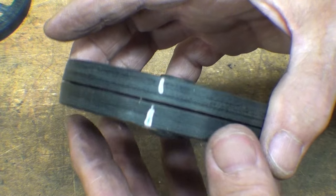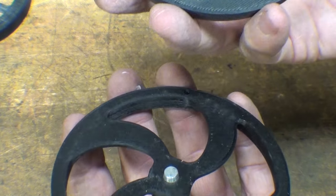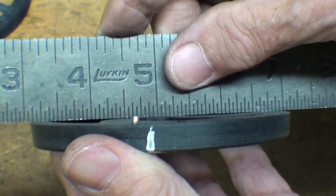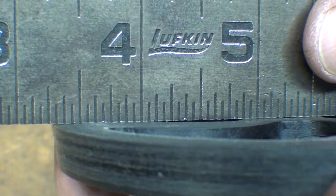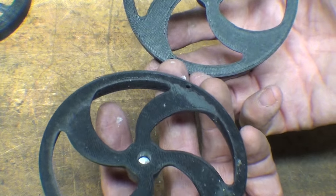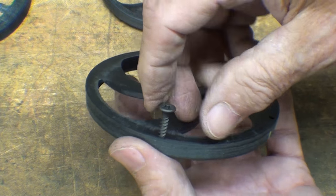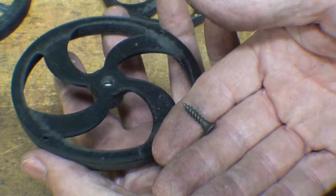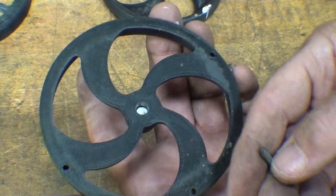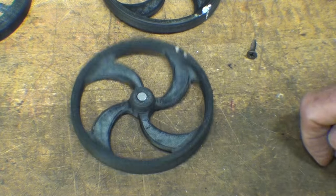This one's ready to go, but there's just one minor problem — even pressing them together there's a bit of a gap. Holding a straight edge on it, I believe there's just a little bit of warpage, but I think I can deal with that. To lift the patterns out of the sand mold I'll use the holes that were already drilled with a drywall screw, because they really can grab and lift it out. I venture a guess there isn't a single guy watching this that hasn't had a drywall screw in their tire at one time.